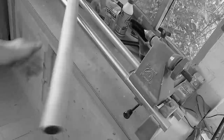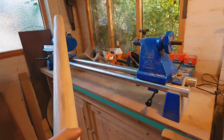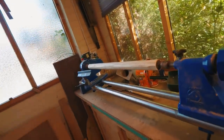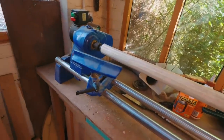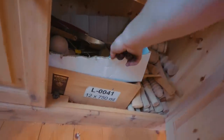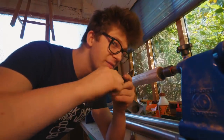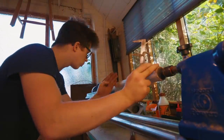We're here at my father's workshop — wonderful memories, great to be back. He has a lathe, however the piece of wood doesn't fit so we're gonna have to cut it down slightly. Now let's see if it fits — hey, that worked pretty well. I need to generally smooth up the circumference straight off the draw knife; it needs to be perfectly round as it goes into the sockets. I do not have a lot of freedom as to how much material I can take off. So the first thing I'm going to do is take this parting tool on either end and in the middle to make a known diameter that is just a hair proud — about 0.7 millimeters — giving us consistent diameters to work to.